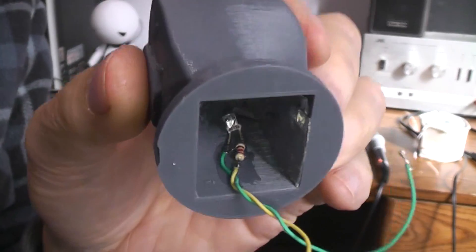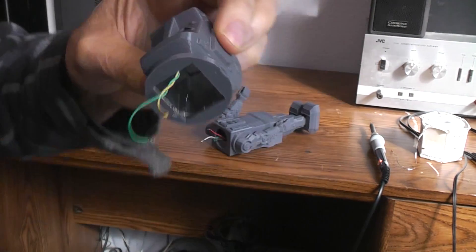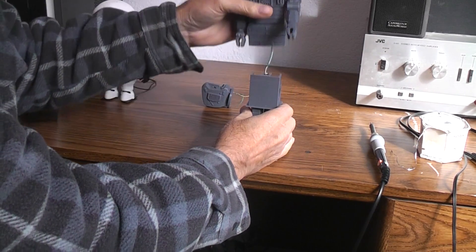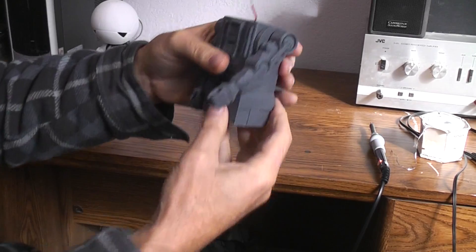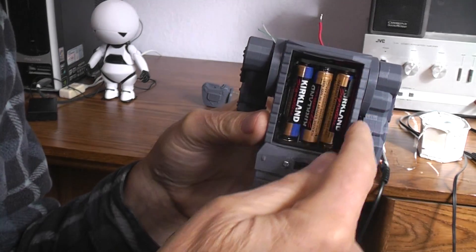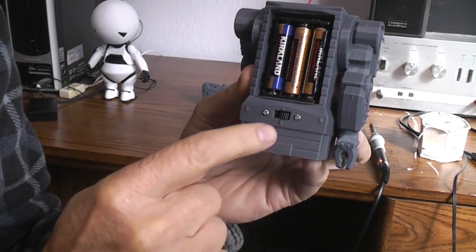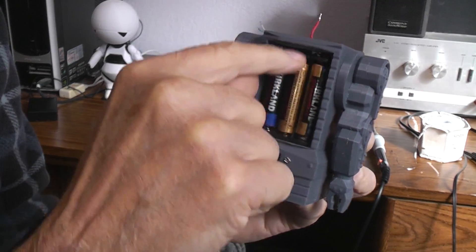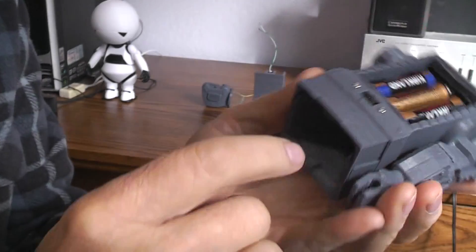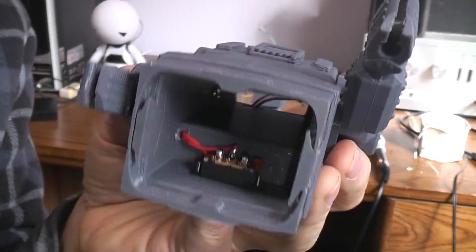There is a current limiting resistor on it as well just to make sure — I didn't need to run it real hot and I don't want to drain the batteries or damage the color changer. On the body side, since there's enough room between the battery holder and the opening, I ran the positive lead from the battery pack down and through a little hole on the side to the switch, then another red wire back up the side so that the two battery leads could poke out the top and not be possibly mixed in with any of the mechanics down below.